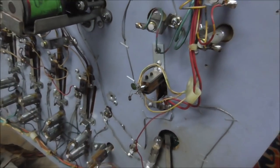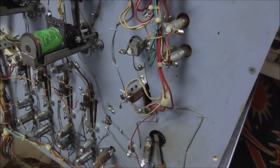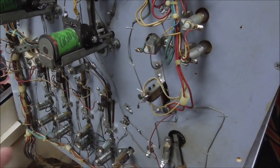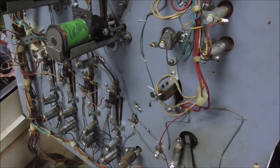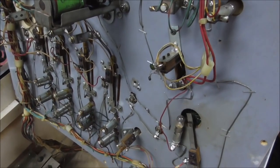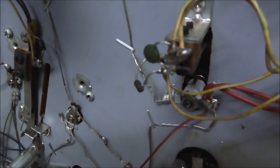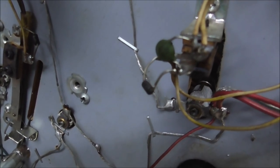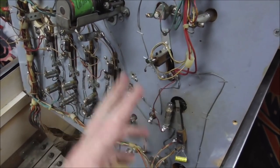If that's missing, what will happen is sometimes you won't get the switch to register because you hit it too fast and then the ball bounces off of it. It just doesn't have enough time for the strobe to catch it, the old school way that they strobe the switches on the Bally MPUs. So on the ones that get hit really fast, Bally added this little capacitor, and it basically stretches the pulse out a little bit of the switch connecting.